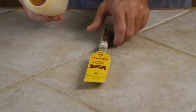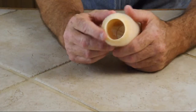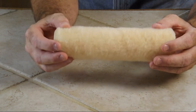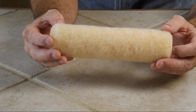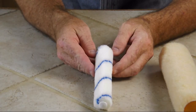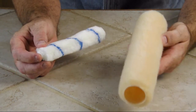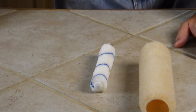As far as rollers go, I don't mind buying cheap ones, but I have a couple of criteria. I like to have a plastic liner. The nap of the roller depends on the job — I usually go with a medium nap. But if I'm doing a popcorn ceiling and I'm afraid of destroying it and I can't spray, I like a thick nap roller. I also like cigar rollers. I can really get in close after I cut in with a brush using a cigar roller, then move to get most of the wall with a larger roller, and then trim out with brushes.